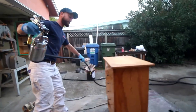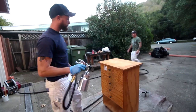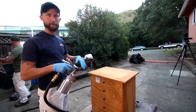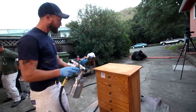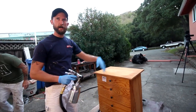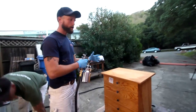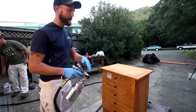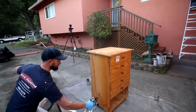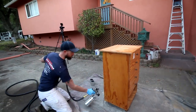Do you have any tips for spraying it? What I like to do is start on the bottom and do any touch-critical surfaces very last — that way there's no flashing or feathering around those areas. We'll work our way around all the bottom pieces, and the very last thing we'll do is the top. You want to overlap with a nice 50-50 overlap, and move pretty quick with lacquer, getting it on nice and even — you can always come back and add more coats.